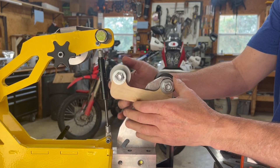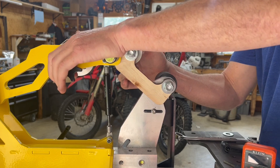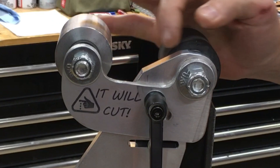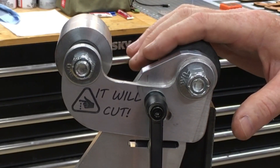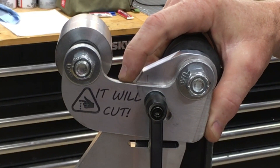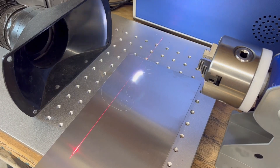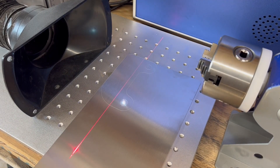I went through so many different designs because when you push the hydraulic piston down you need clearance between the end and the wheel. I went through several iterations of how low I wanted the notch to be in the aluminum to give me enough clearance but also leave enough material there for strength. Once I dialed it in on my sixth iteration, I transferred that design from Lightburn to my fiber laser and outlined it on the aluminum. Then I took it to the drill press, drilled my holes, and cut out and shaped the aluminum with my 2x72.